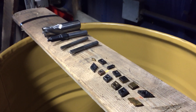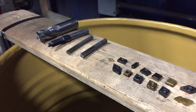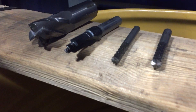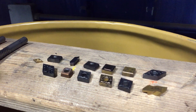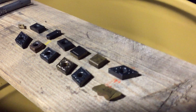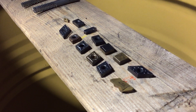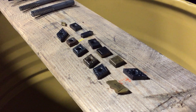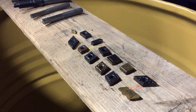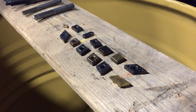Now a couple things that you need to know about carbide. Generally our pricing online is based on material being 80% to 90% tungsten. When you have some material that we use with our analyzer and it's below that, the market pricing goes down. Now these tips that you can see right here are actually only 30% to 40% tungsten with a titanium coating and they're mixed with multiple other metals, so these were bought at a much lower rate opposed to what you see online. Online we try to use a basic price guide to give you a low end and a high end for our 80% to 90% material, but of course we always reserve the right to change the prices due to market conditions or material grading.